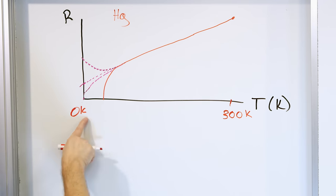And it has to do that, by the way, because if it didn't, then you have a larger and larger magnetic field. Because it's a superconductor and it's perfect, you would have a magnetic field that would grow forever and with infinite, because magnetic fields store energy, you would have a free energy machine, and that can't happen. So in the real world, when you bring this thing down, the magnetic field begins to cut through this conductor. It generates an electric current, which produces its own magnetic field, which tends to cancel this magnetic field approaching, so that the end result is, we say, superconductors do not allow any magnetic fields inside of them.